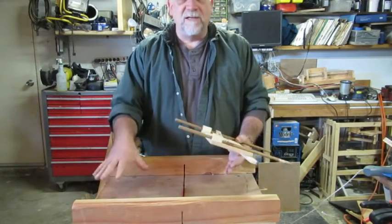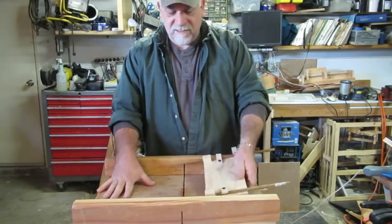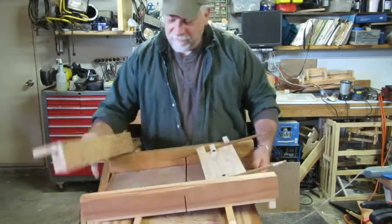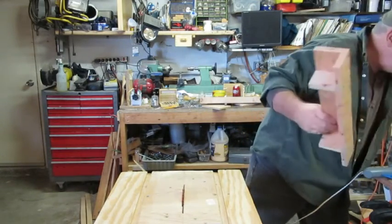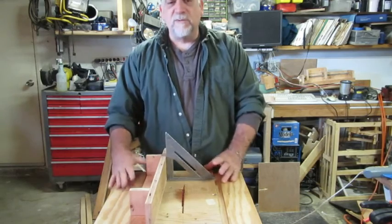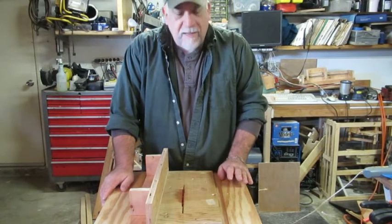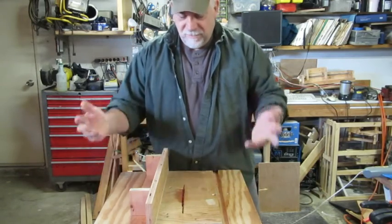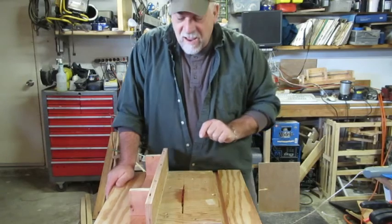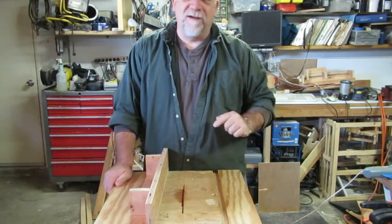Okay, mission accomplished. We've got an accurate crosscut sled. We've got a rip fence setup gauge that allows me to set up my rip fence more accurately than on a store-bought piece of equipment without one of these things. We can make crosscuts that are just as accurate, or maybe even more accurate, than using the miter gauge that came with my store-bought table saw. So far, this piece of equipment is turning out to be a real handy and accurate piece of equipment. Since I've got these two pieces and was able to make accurate rips and crosscuts, I was then able to make a perfectly square rip fence. And the design of this rip fence is the basis for the design of the next two jigs we're going to build in the next video. So I'll see you next time. In the meantime, you all keep up the good fight. Bye.